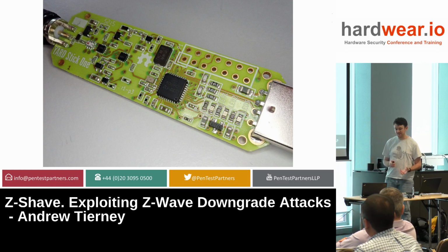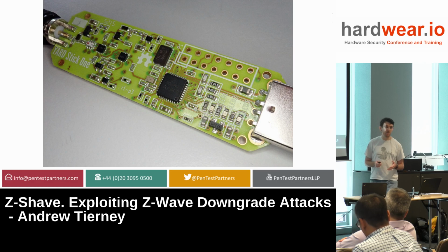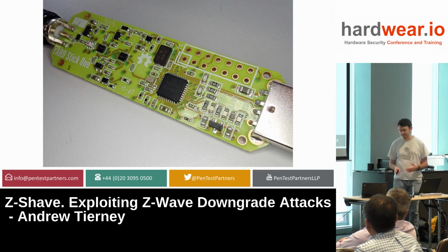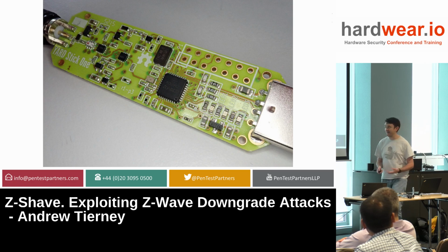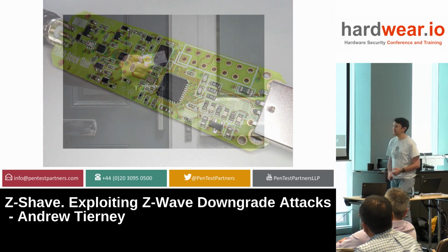And the reason we use it for a lot of these attacks is it has half a watt of power output. Now, an SDR's got maybe 10 milliwatts tops, which makes practical real-world attacks quite difficult to carry out. Half a watt, if I set that jamming on 868 megahertz in my house, causes widespread disruption in the area. People's burglar alarms stop working, they can't unlock their cars. It's got enough power to cause problems.